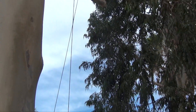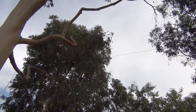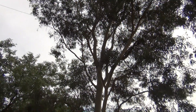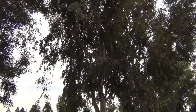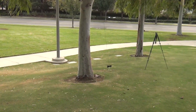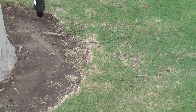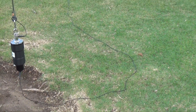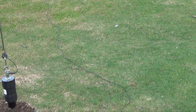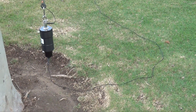You want to try and keep your horizontal leg at about 25 feet. It's recommended that a counterpoise be used whenever possible. If not, your coax cable must be about 25 to 100 feet in length.